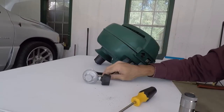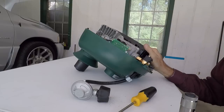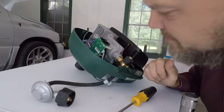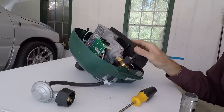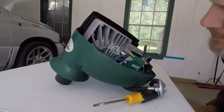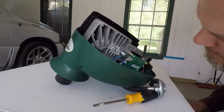There she is. Okay, so we have the on/off switch, this is the purge valve, that's the inlet, this looks to be the burner assembly, and assuming this is my igniter - who knows, any one of these things could be the problem. What I do see - I'm thinking this is a thermocouple or a flame eye, and that is pretty crudded up.